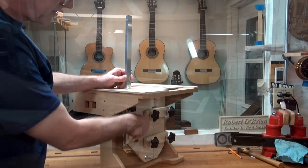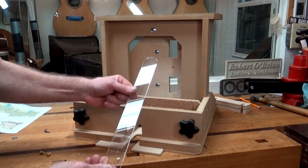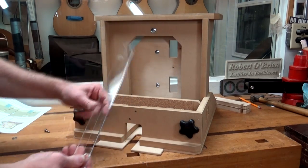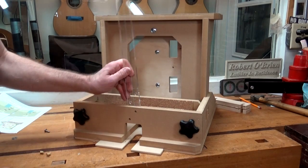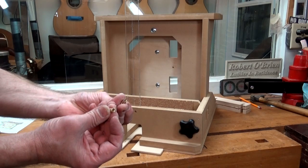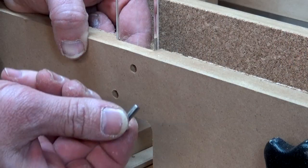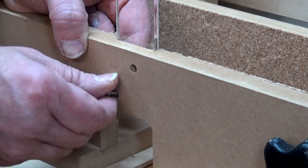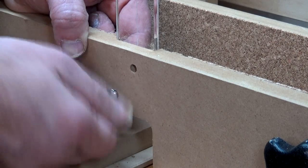for your guitar. One of the improvements over my original jig is that there's a center line on the LMI jig. The two holes in the plastic piece here with the center line on it will align here in this groove with the two holes pre-drilled. Once they're aligned, place the two inserts in from the back side. Then place the two screws through the holes and into the inserts and tighten them to hold the center line in place.